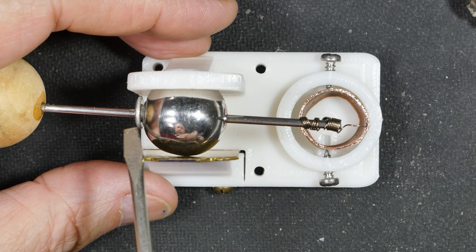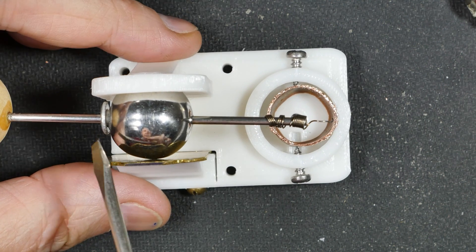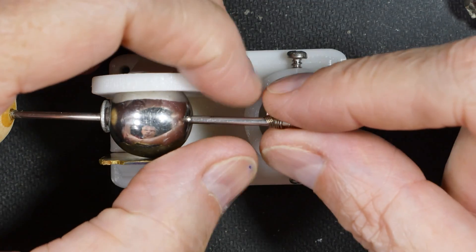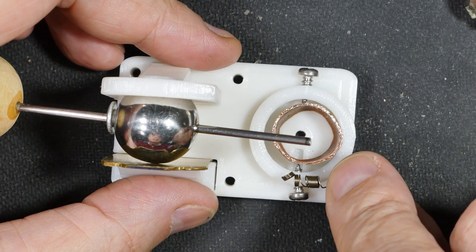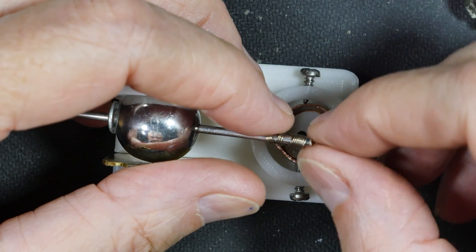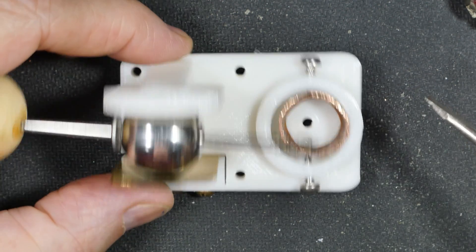If you happen to order this type of ball with the larger hole, I used part of a pop rivet — the aluminum part — and I crushed it down to fit the shaft and put it in there. I didn't pop it; I took the metal pop part out and I'm just using that aluminum collar. Another construction note: the spring wasn't fitting very tightly, so I bent it in three different directions so that when you put it on you have to bend it a little bit more, get it on there, and then rotate it into the correct orientation. That makes it a lot firmer.